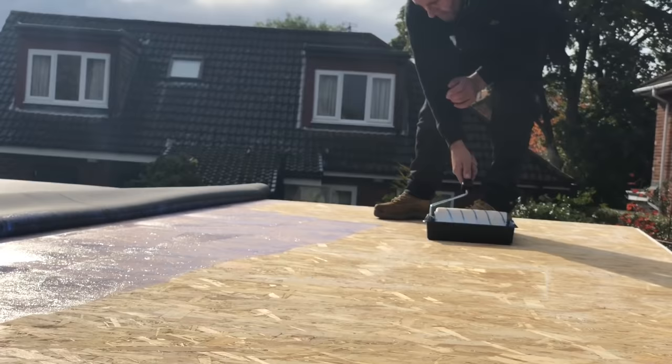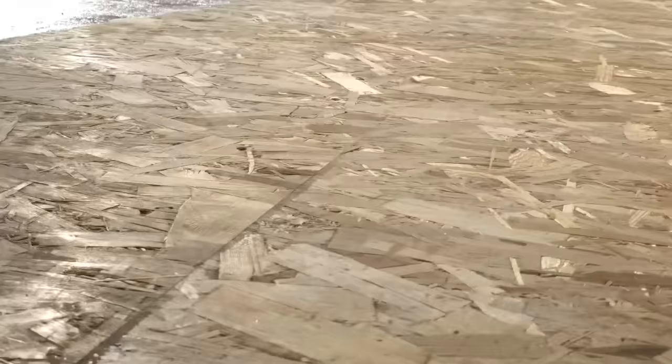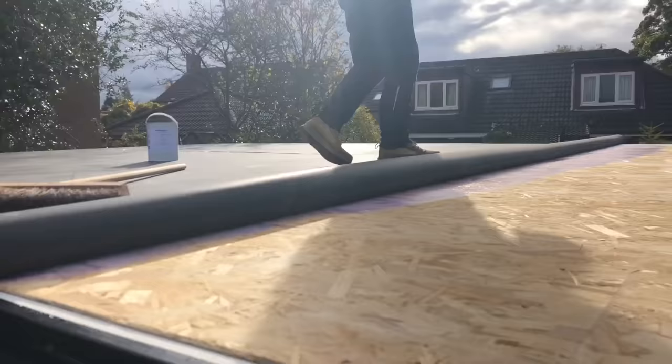And then we'll put on our trims, the two-part gutter trim. I already put the first part on. Adam, can you show them the first part of gutter trim there? So that's the first part, it screws to the building. What it actually does then, the second part forces the rubber up into the groove, which traps the rubber and the rain pours off. There's another one on the market where you nail through it, which seems mad, but that's what you do with that one. But in my opinion, the two part one's the best on the market. You're not actually puncturing it by putting nails through it, and it traps the rubber. So there you go, that's it.